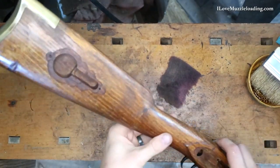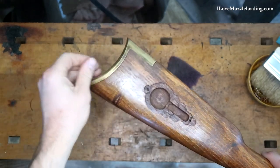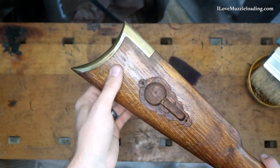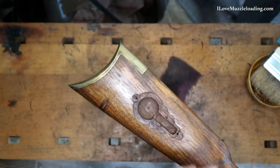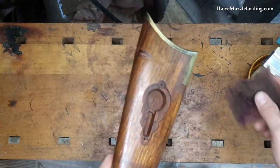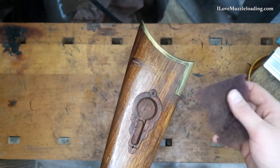As usual here, life kind of gets a little busy, and you can see here in between our last coat and now we have a bit of oil buildup on the stock. I want to make sure I'm getting rid of that. It's a little sticky, and this is a side effect of applying too much oil and not getting back here soon enough to wipe it down. I'm not too worried about that though, and I'm showing you this just to show you how I go about it.